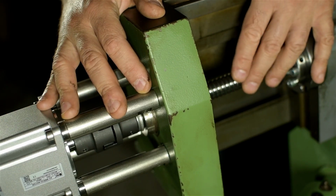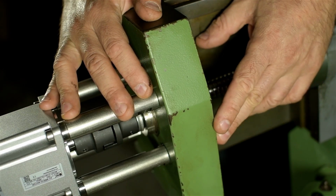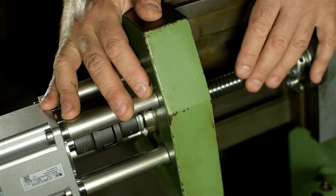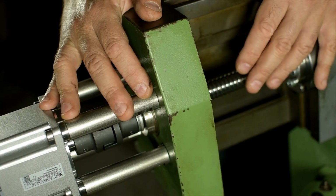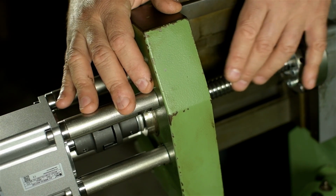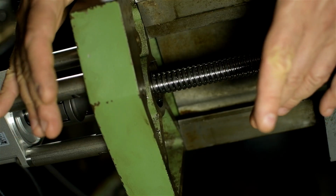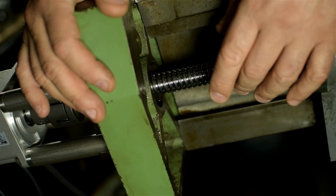The thrust bearings that keep the screw in place. At the end of the screw, inside of this end cap, there's a thrust bushing pack that keeps the screw rigid to the table, but allows it to rotate freely. To state the obvious, X needs to translate perfectly with the table with no slop in it, no backlash. But again, miracle of miracles, that just fell in my lap too.